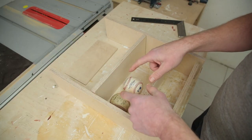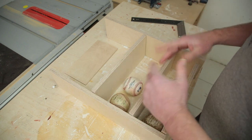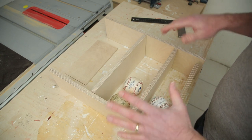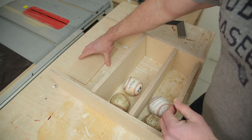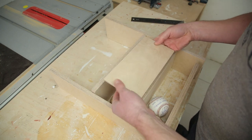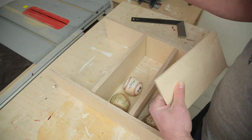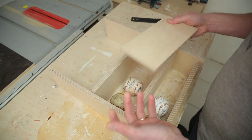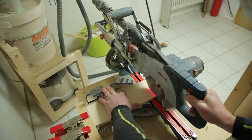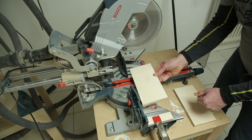This is the general workup I'm thinking about — two rows of four balls or so. I have a bunch of three-quarter inch plywood, but I'd rather use up the little bit of half inch I have left. For the back, I'll use quarter inch plywood, but I'm going to set it forward so I can get a half inch French cleat in behind to mount this on the wall. Next up is to cut all the pieces to width, and then cut to length using a stop block for repeatability. Two sides, three cross pieces.